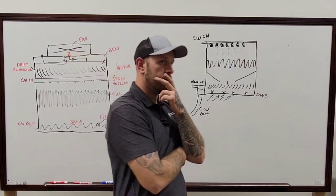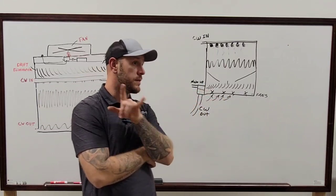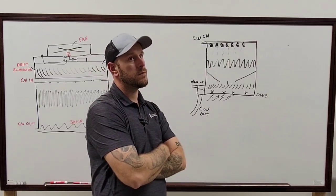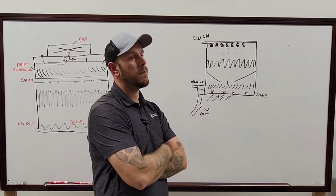It's just closed loop, but it has two separate loops. Right, because coming off of your heat exchanger, you have a different set of condensers. Yeah, condenser. The building. Exactly, that runs back just out. Just the tower and the heat exchanger. Exactly. It doesn't make the tower closed loop. It just means that they have two loops. Right.